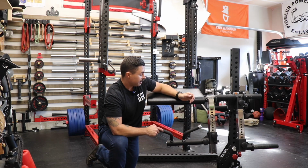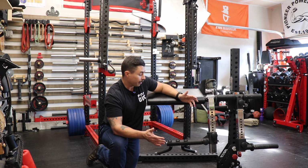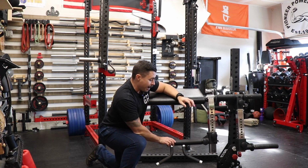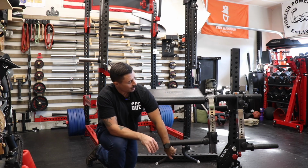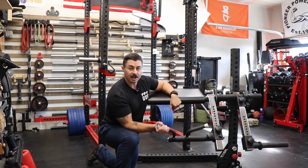So like right there, the handle's not even rotating until the weight overcomes it right about there. So if I was going to create a little bit of improvement, I would actually probably gap that a little bit. Although I will also say that under load, it still rotates freely even when it's completely tightened down.